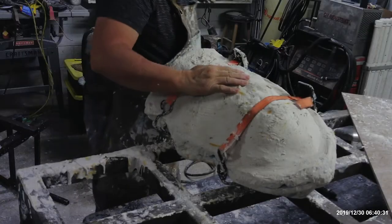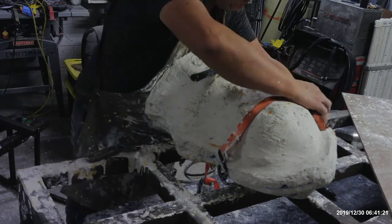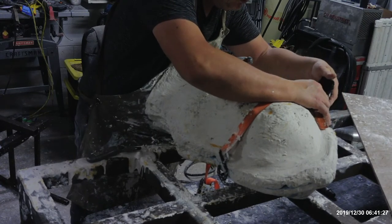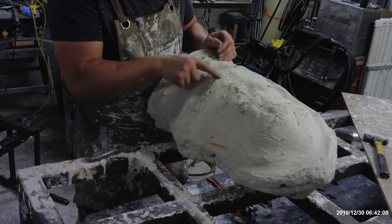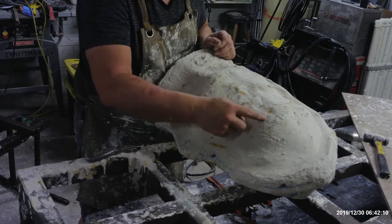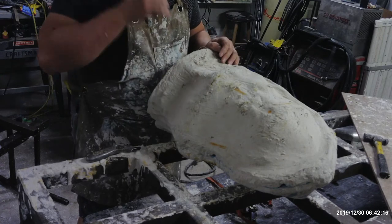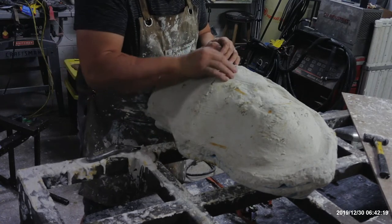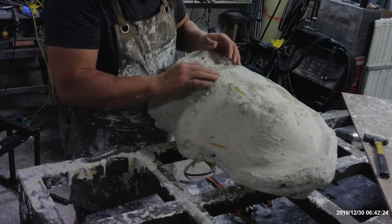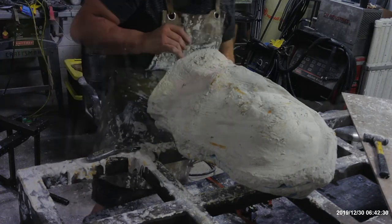Determined that this is the back side, and so what we got to do is break out the back side first. Now I can see from the rust, the rust shows me where the irons are. So first thing to do is chisel down to the irons and remove the irons. And that way we won't go into the blue. We're going to chisel down to the blue and then remove the blue coat very gently.